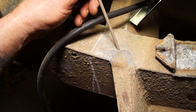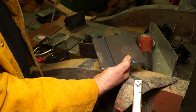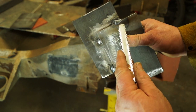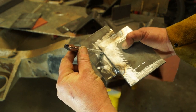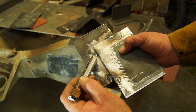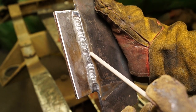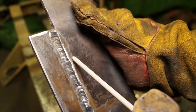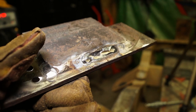This will be fillet welded on both sides. The lap joint is where two bits of metal are lapped over and then welded. Something to observe: the bottom plate absorbs more heat than the top plate because you have more area for heat absorption. You'd start on the bottom plate with an angled electrode, working in to the top plate edge — almost like sweeping leaves up onto a curb. If you get too excited you can get undercutting, which shows there's possibly a little too much amperage.